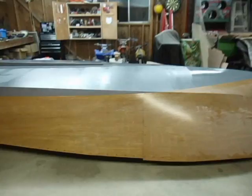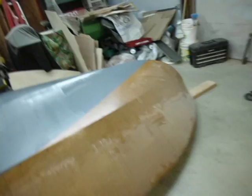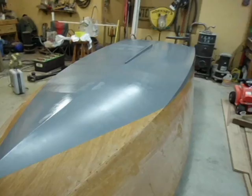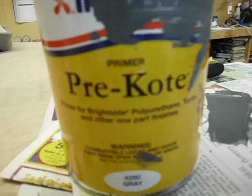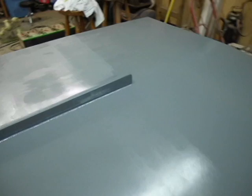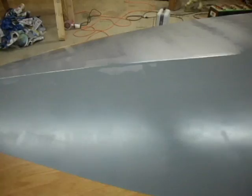There it is — a perfectly straight line when you're looking at it. I chose the gray primer because I'm painting a dark color and figured it would help it stay dark. I was afraid the white primer might lighten up my bottom color. This is Interlux Pre-Kote primer, a one-part polyurethane. I chose it because I wanted to use Interlux Brightside for my bottom paint, so I'm staying all Interlux brand. The fillet looks pretty good down the side of the skeg — no obvious lumps or bumps.